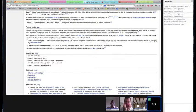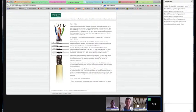It's like those other standards. It's a twisted pair copper cable. Like Cat 6A and Cat 7, it's what we call a PiMF cable, pairs in metal foil. So each of the pairs, the orange twisted pair, the green, the blue, and the brown twisted pairs, are shielded in their own screens. And then the cable has an overall shield. And so it's quite a stiff cable. And they've gone beyond relying on the harsh twist ratios. So if you open up a bit of Cat 5e cable and you look how much the different pairs are twisted, of course the pairs are twisted differently, so each pair gives a different common mode rejection for noise immunity. And when you get to Cat 6 cable, they're twisted an awful lot more to try and give you a bit more common mode rejection.